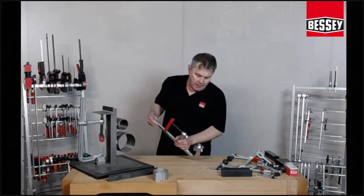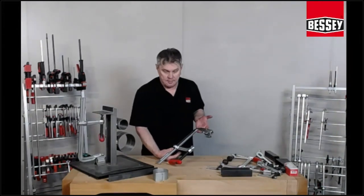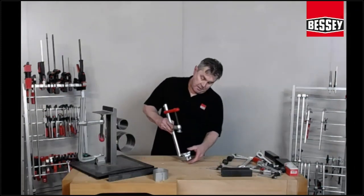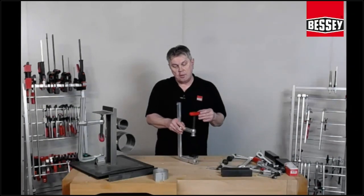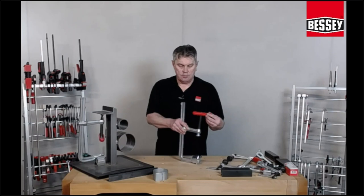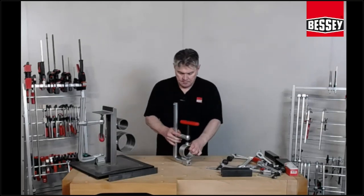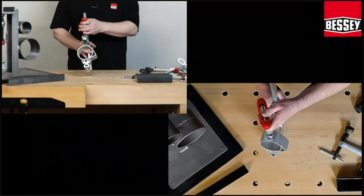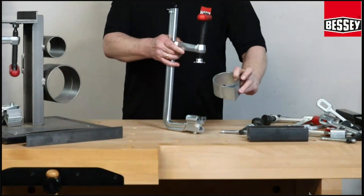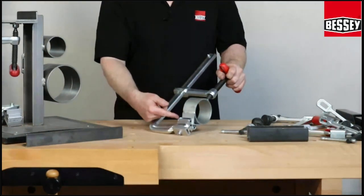I'm back to the last session. We have here the SG-VAD, the SG-clamp assembly. On the Tommy bar there is a special plastic protector — it's more comfortable when you close and turn with the hand. You can slide the Tommy bar. The special of the clamp is you can fix very easy round things. The pipe does not move out. Or you can fix special forms. Close, close — now you can start welding here for the special form.